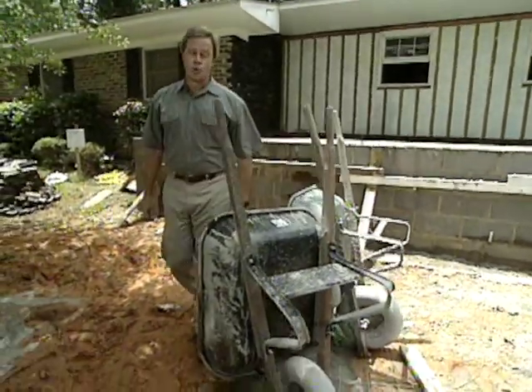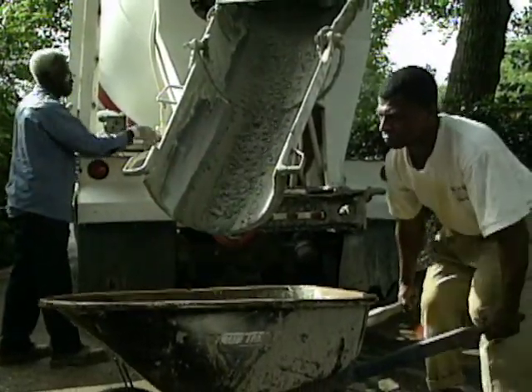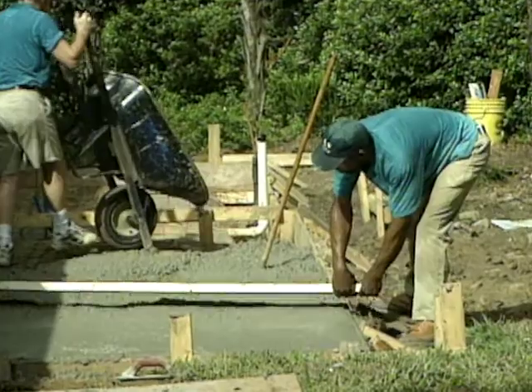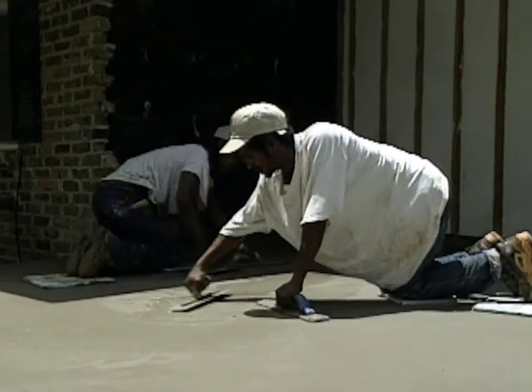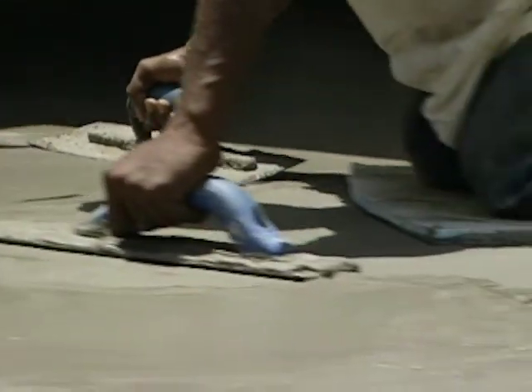Since this morning, we've been able to get this slab poured. The concrete truck arrived and quite a bit of wheelbarrowing took place to move the concrete from one side of the forms to the other. After that, using a concrete rake, they start the leveling process. Then they break out the old-fashioned screed board — a good straight two-by-four — to get a real good leveling started on the overall slab. After that, it's time for the bull float, an aluminum tool used to rake across the surface and start finishing the top of the slab. Then a hand trowel — normally magnesium or steel — is used to really fine-tune the finished surface.